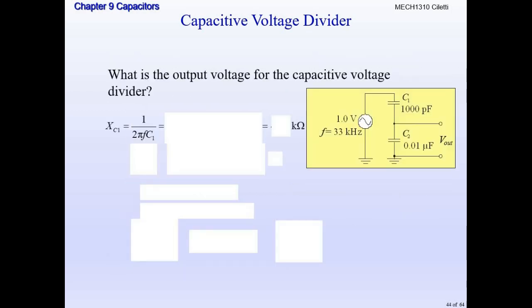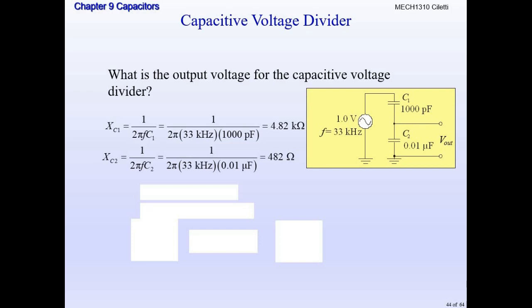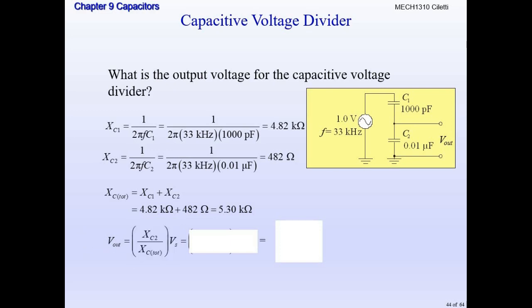All right, so let's solve it. The first thing we need to do is find the reactance for capacitor one, and then we find the reactance for capacitor two, just using 1 over 2 pi fC for each one. For the first we got 4.82 kiloohms, the second one we got 482 ohms. Now we can just use our voltage divider like we did in chapter two. We find the total reactance, and then we take the specific reactance of the capacitor where Vout is, that's the reactance of capacitor two, divided by the total reactance times the voltage source. So we get 482 divided by 5.3 kiloohms times 1 volt,